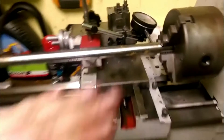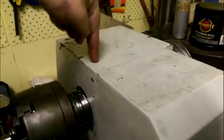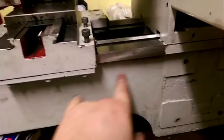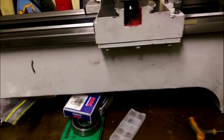The next step will be to adjust for the pitch to make sure it's tightened down equally on the four studs. Once that's done for the headstock, the motor can go in. At the same time, I think the motor comes out to about here, so I'll put the scales in around here. That'll happen either tomorrow or the day after.